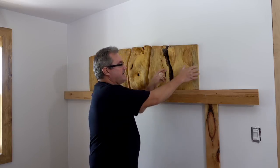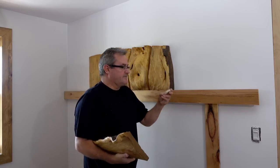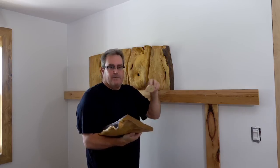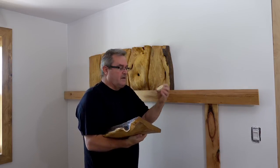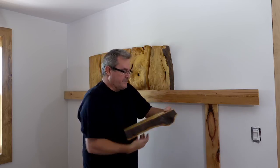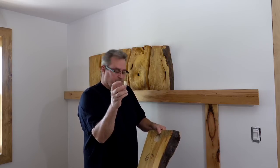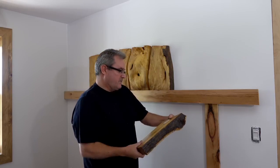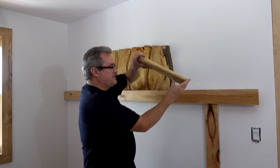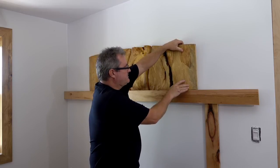To do that, I'm going to take each piece down. And I've got this block, or a round piece of wood. This is actually the blank cut from the hole saw when I made the template for routing these out. I just sanded it down so it'll fit in there snugly. And I've also put a screw that's poking out. So I'm just going to orient that straight up and down there, and then take the piece and put it in place, spaced where it's supposed to be,